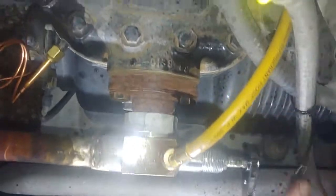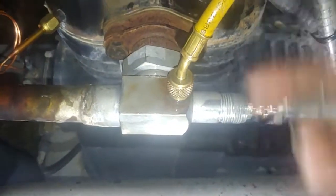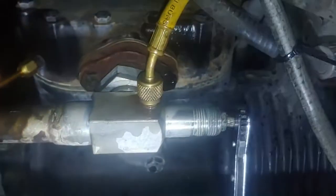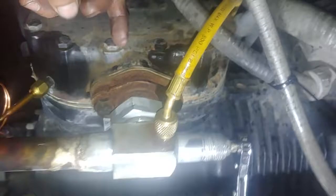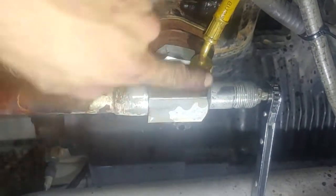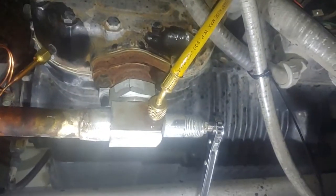The last position is fully closed — push the plunger all the way to the other side of the valve. This isolates the compressor from the line set. At this point the plunger is fully seated, and we now have open passage between the compressor chamber and this vent right here. That's how the king valve works, hopefully that helps.